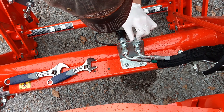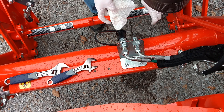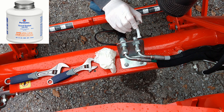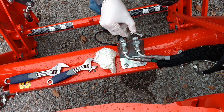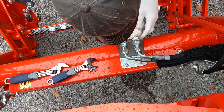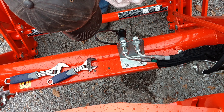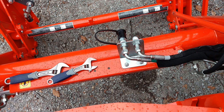Parker recommends that even on a first install with tapered threads like these, you should put a little pipe dope on the seating surface. I got the Teflon-containing pipe dope - it provides less friction when putting the part on. Paint it on there, but you don't want to get it where the hydraulics will touch. You don't want to squeeze any down in there. I'm cleaning off a couple of thread spacings at the end to avoid that. I'm wearing gloves because I don't like hydraulic fluid on my hands.